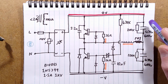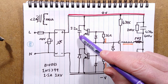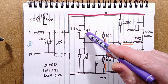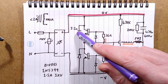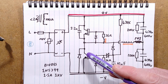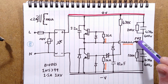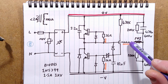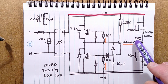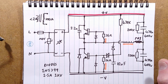So there is one small other aspect to the circuitry. Now, a couple of things. There's a 2.2 nanofarad capacitor across this transistor and a diode across this transistor. I think they might largely be to protect against high frequency, high voltage capacitive coupling coming back from the secondary to ground via the primary and creating rogue voltages that would make this circuitry go bang.